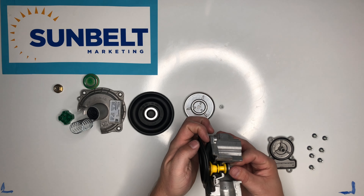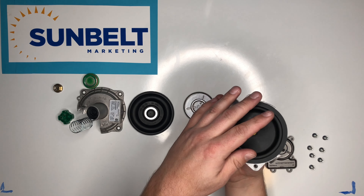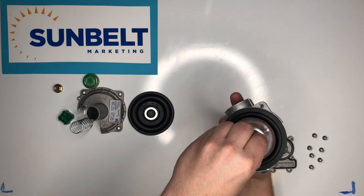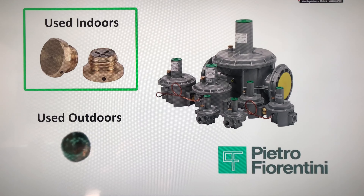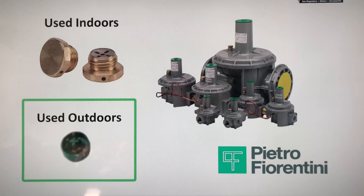Here's how all of these diaphragms fit together. The balanced shutter and yellow piston connect first to the worker diaphragm, which is protected by a small plate. Then we connect the safety diaphragm, which has the pinhole. So if that worker diaphragm ruptures, the safety diaphragm becomes an integral vent limiter, and gas proceeds onto the external vent limiter — which is that brass plug that has a ball check in it — allowing only a certain amount of gas into the outside atmosphere.